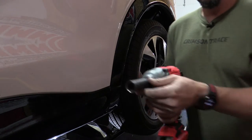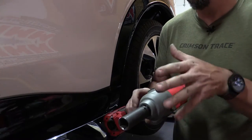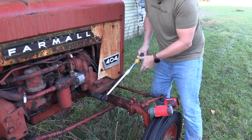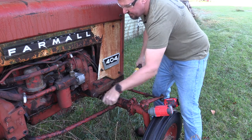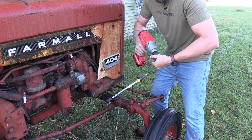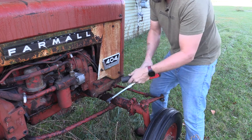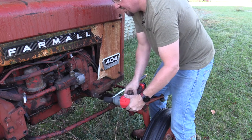Not bad, but what I do notice is that we still have a lot of spinning happening after I let off the trigger, even when I'm impacting. Not that it's a huge deal — it's just something to get used to. So 250 foot-pounds — this thing is rated for a thousand. We should have zero issue with this. I want you to listen to how long it takes to pound its way off. We're running a five amp hour battery; it comes with a four. And nope, it took her right off.